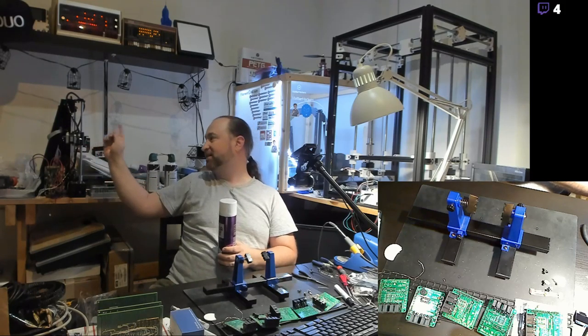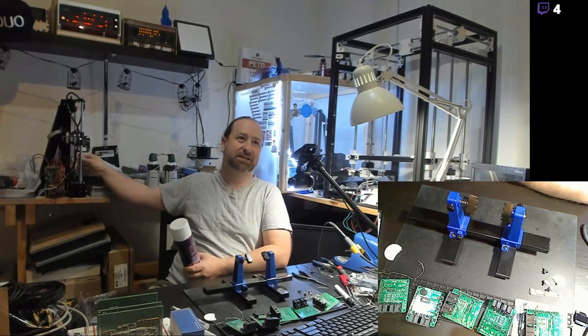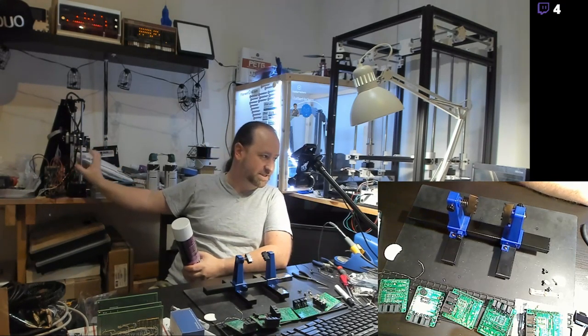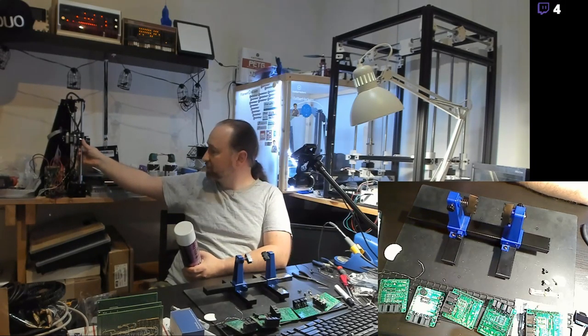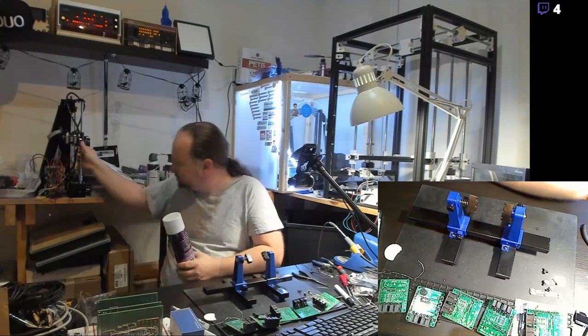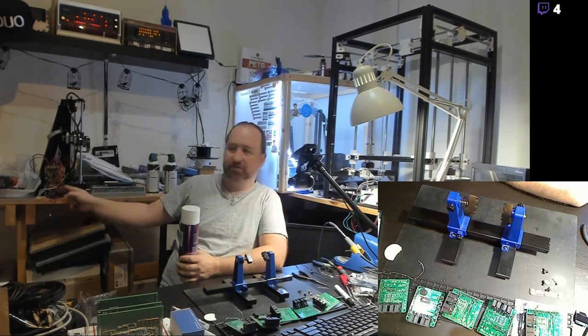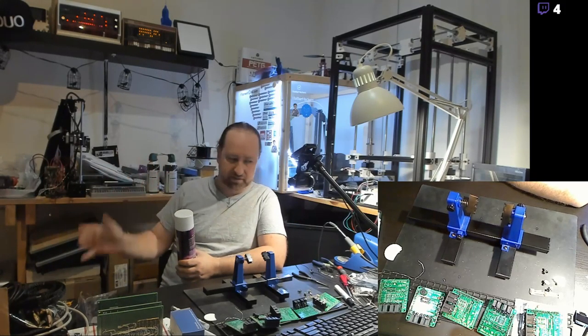Yeah, this thing technically can print, it does print, but I don't use it for printing. It's my test bed for testing out control boards. Currently, there is a Gen L on there with the TMC 2130 drivers on it, and it's just mounted there temporarily so I can test out motion and configs.